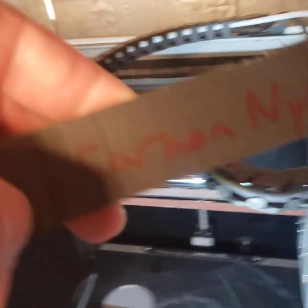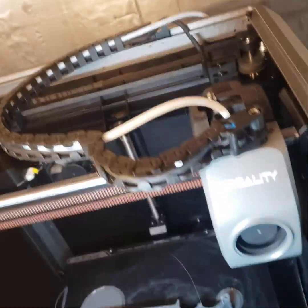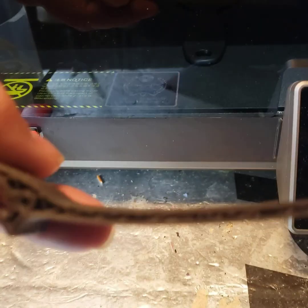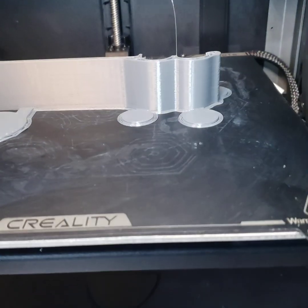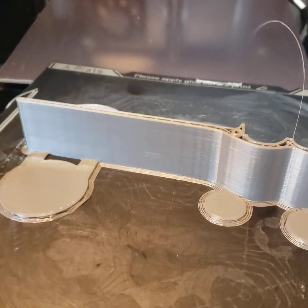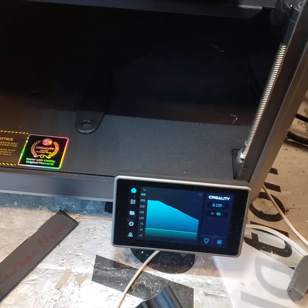The carbon fiber reinforced nylon I can bend practically into a U-shape — I can really bend it and it mostly springs back with no cracking. I can twist it with no cracking either. Let this cool down a bit. I have custom bed adhesion shapes because this shape really likes to pull up off the bed, especially with all the internal stresses — as you can see with the cracking on the ASA version. I'll put this up in front of the cooling fan to cool off.